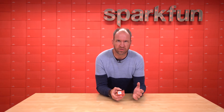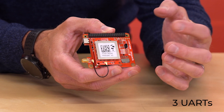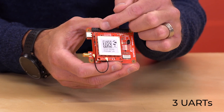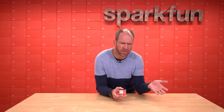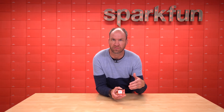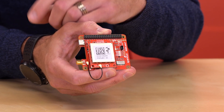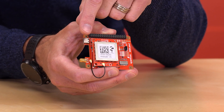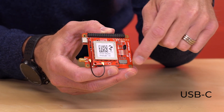What we found is that almost all these high-precision receivers share a lot of the same outputs. They all talk UART. In this particular case, we've got three UARTs from the Flex socket back to the Raspberry Pi header, so you can have a communications channel talking NMEA and a configuration channel for actually configuring the module. All the modules share those UART interfaces. A few modules have some external hardware support — for example, the Mosaic supports USB where some of the other modules do not.